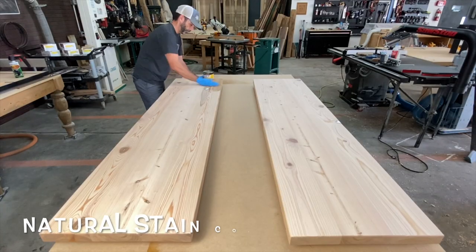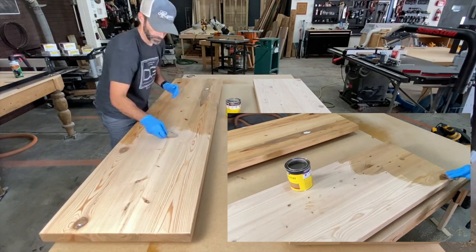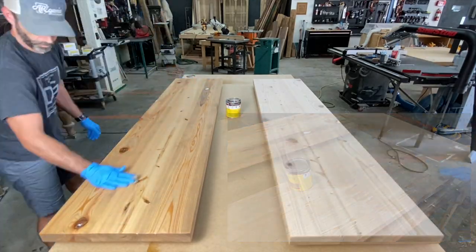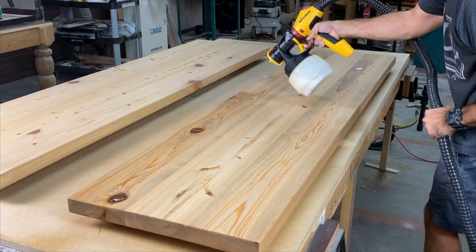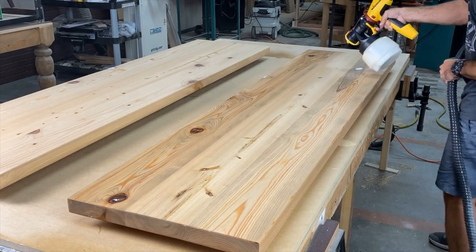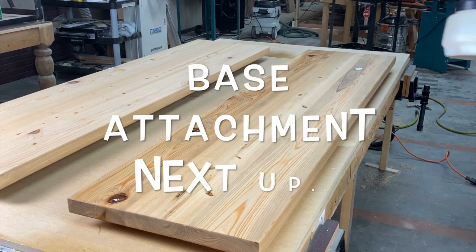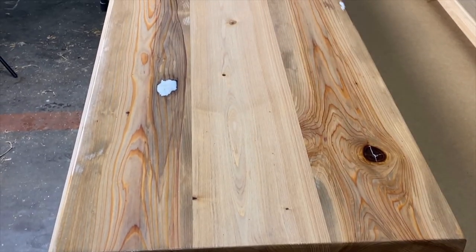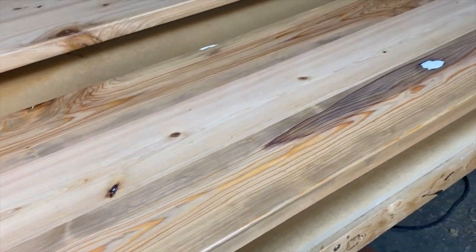In efforts of keeping these benches approachable and DIY-friendly, I went with a simple stain from Minwax. I'll have the color in the description box below if you're interested. You're probably also wondering why there's white resin filled in the knot holes and cracks — I made these benches to match a dining table I already made for a client that had white resin poured all over it, so this ties that in. I'm using a polycrylic finish — water-based, easy cleanup, and fast curing time — on the top and bottom of these benchtops. Whenever you're sealing a dining table or bench, be sure to do the underside as well as the top to keep things even, especially for moisture control and seasonal movement.